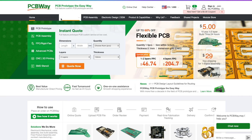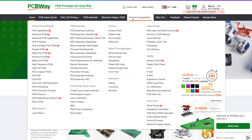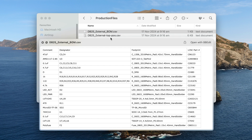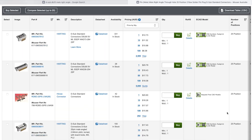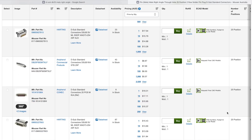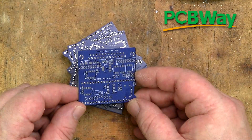I'm only getting boards and won't be getting any PCB assembly done, but this is something PCBWay can provide as well — the number of different services PCBWay provides is quite dizzying. Also included in the Blue SCSI source is the BOM, or Bill of Materials, which conveniently lists all of the LCSC Electronics product codes, making ordering really easy. Some components are so cheap it makes sense to order in large quantities — like these resistors. I only need a handful, but buying a thousand costs less than $1, so now I have plenty of spares. You'll also need to source the DB25 male connector and Raspberry Pi Pico, but these are very easy to find. I received my Blue SCSI PCBs from PCBWay in just a few days, and they look great — they threw in an extra, so I now have 11 blank boards.